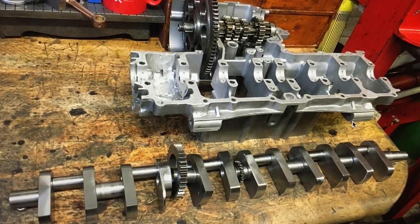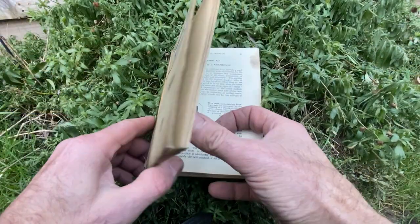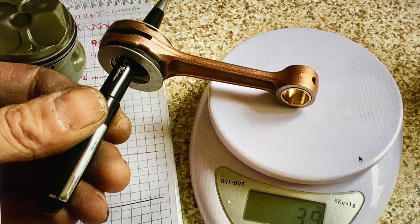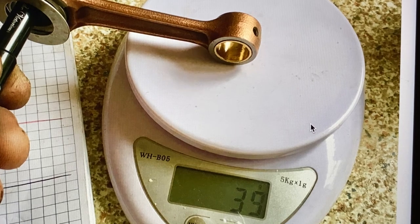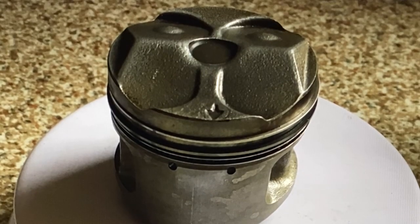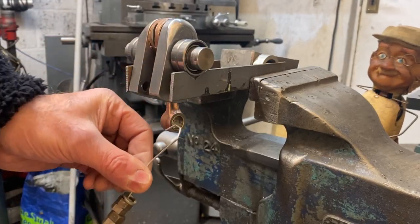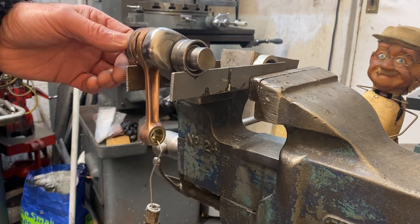I laid out the parts on the bench and it was starting to look really good, but next I had to fine balance the flywheel webs. I used a method described in my old 1955 book called Tuning for Speed that describes how to balance crankshafts — doing them one cylinder at a time, and when you put them together in a straight six they're perfectly balanced. You weigh the reciprocating mass and the rotating mass: the little end is part of the reciprocating mass, the big end part of the rotating mass, and the piston is part of the reciprocating mass. You put the figures into the formula and it tells you the weight to hang on the connecting rod so you can spin the crankshaft and it stops in a random place every time. Here you can see my test crankshaft resting on its needle roller bearings — when I add the calculated pile of weights to the little end eye, wherever I leave it, it stays stationary, showing it has perfect static balance.